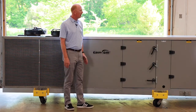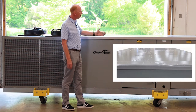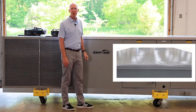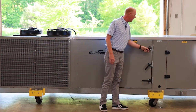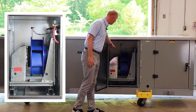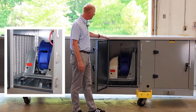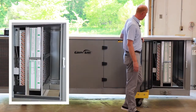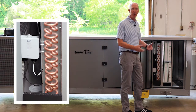One other thing I want to point out is our roof structure. It is sloped from the primary side to the back side, so on a normal rain day water is going to leave coming off on this side — that keeps the electrical panel from having any drip over there if you happen to be in it on a rainy day. The first cabinet you'll see in the middle is actually the blower access panel. You'll see our EC-driven blower in this unit, and you can also see the electrical heater as well — you're going to have access to both of these devices in this panel. In the last section at the intake is another access point for filters, and you can see another temperature sensor here — that's the off-evaporator temperature reading that'll be transmitted over air guard and also be on your controller.